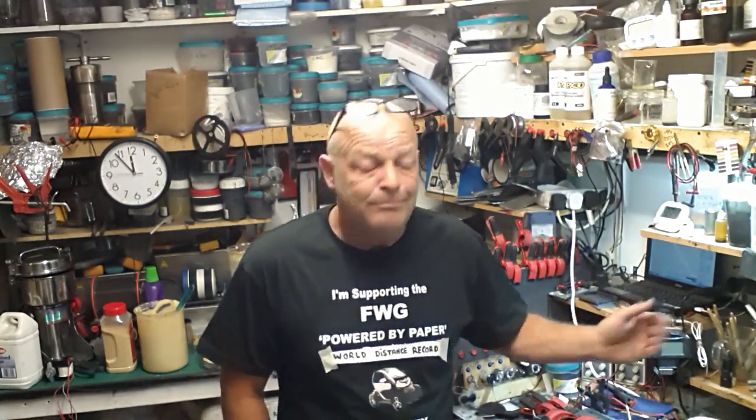86 milliamp hours, which effectively means it can run for 86 milliamps for an hour. So what I've done, I've chosen 70 milliamps as the load, and that's what it's doing now. I'll include the results on the end of this segment as well.